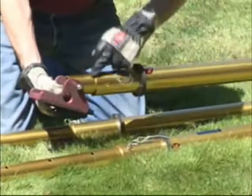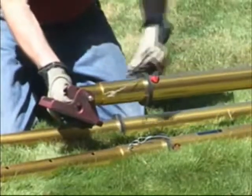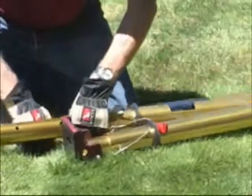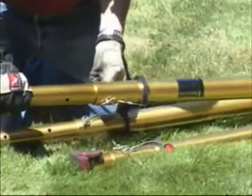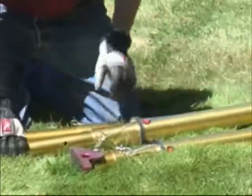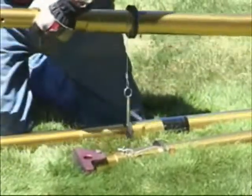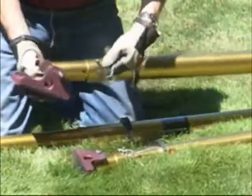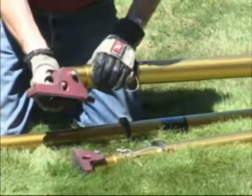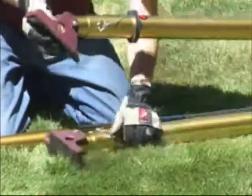You can tell the holes are lined up because the letter L on the outside of the leg will be just below the upper tube. Rotate it a little bit and the pin goes right in, then put your hairpin key into the pin so it won't come out. Always work on the center leg because you can always see the letters right on top. One person can do this job more efficiently and easier than two or three people trying to put the pins in at the same time.